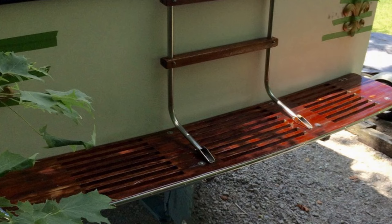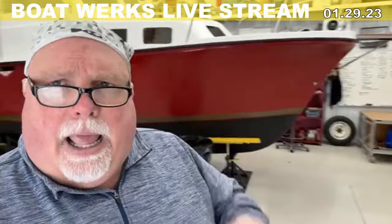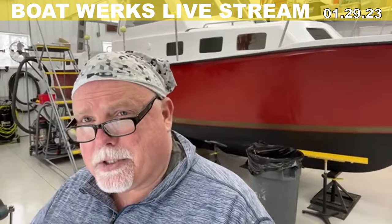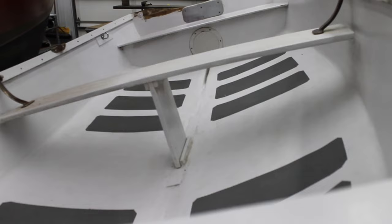The other choice is to put the dinghy on the back of the boat on the swim platform — a teak swim platform that goes on the back of the boat. It's about 21 inches wide and mounts with some stainless steel brackets and support struts. A lot of people take their dinghy and put it on the back of the trawler, propped up on its side. There are commercial davit systems — Weaver systems, snap davits, and various other retail options — that let you raise the dinghy and stand it on the stern against the transom. But I don't like the idea of putting my ultralight dinghy on the transom that way. I think it's going to damage the dinghy over time and it's just not the right way to do it on this boat.